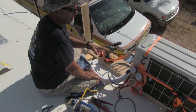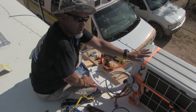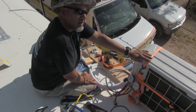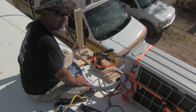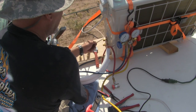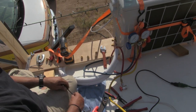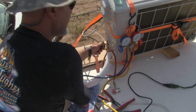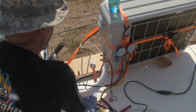They say it's good for 16 feet — these units come pre-charged for 16 feet of hose. We're using probably 30, so I imagine we'll probably need more. What will probably happen is the unit up there will get too cold and freeze up. We'll see. So we just loosen it like this, and all the Freon pre-charge just went into the system. All that's left to do is go power up the system and have cold air. We're there — let's go try it.